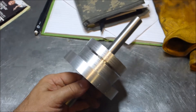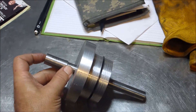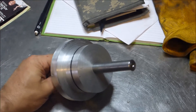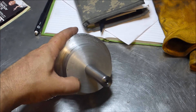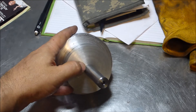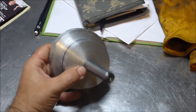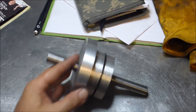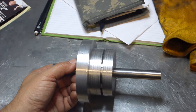I could make another slightly larger tapered spindle. But what I think I'm going to do is — this thing has to be keyed anyway, and I have a broach set — so I think I'm just going to go ahead and put a slot in this, broach this guy, broach the slug, and work with it that way until I'm ready to basically finish it up.